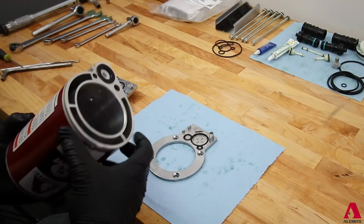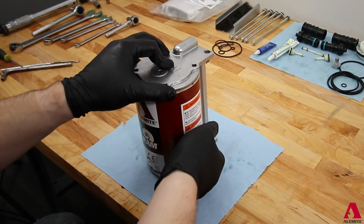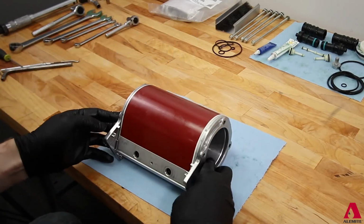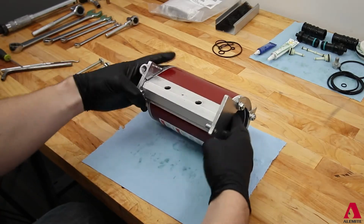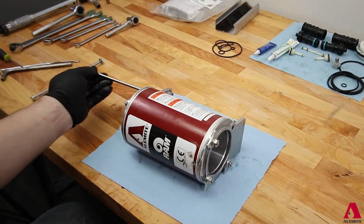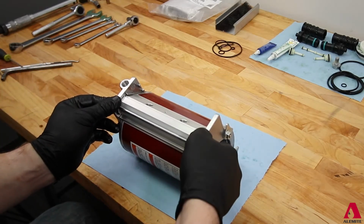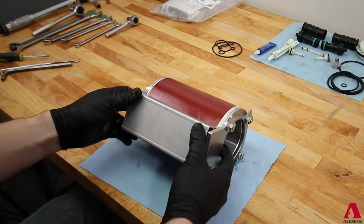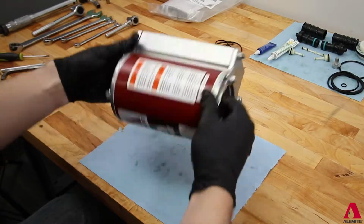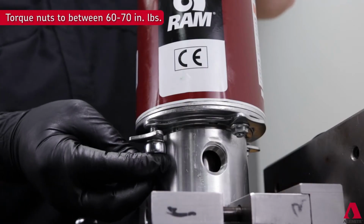Use the label on the cylinder as an orientation guide to assemble the bottom and top caps to the cylinder, using the tie rods to temporarily hold the components together for installation onto the pump outlet body. Be sure not to allow any of the seals to dislodge from their placements, or an air leak will occur. The assembly is now ready for installation to your pump assembly. Simply follow the steps shown previously to attach and lock down the air motor to your pump assembly.